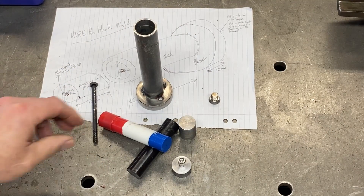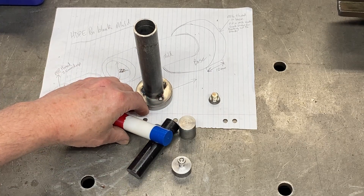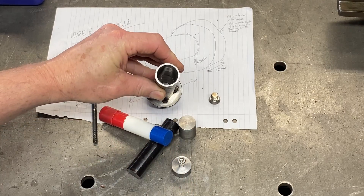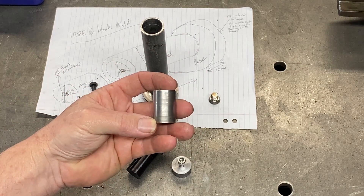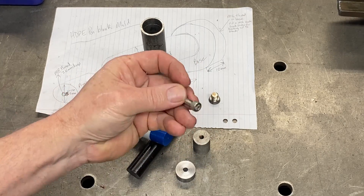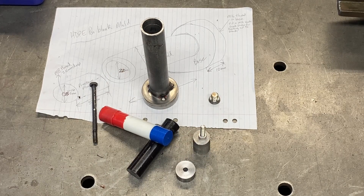I give them both a spin up in the lathe just to see what they came out like underneath. I cannot see any air bubbles or any cavities or anything in them, so I'm very happy with those. Now the hard part was trying to get the molten plastic down into the tube. If I used a bigger diameter I don't think we'd have much of a problem, but it's a little tricky for this small diameter. The other thing is I need a longer plug — when I wound it up in the vise I had to use a screw screwed into the end just because the plug got pushed in so far it went further in than the edge of the tubing. If I use the mold again I may consider making a longer plug.